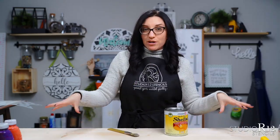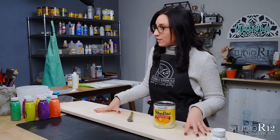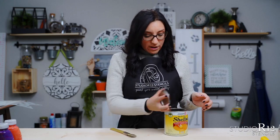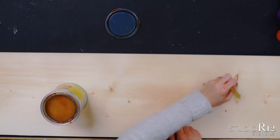Let's dive right in and start prepping our surface to paint. When you paint on a pine surface you're going to have lots and lots of knots on your surface that if you don't cover up with something they will bleed through. We have a project that we did in the past before we knew any of this — we base coated it white and you can see all of the knots that have bled through over the years.